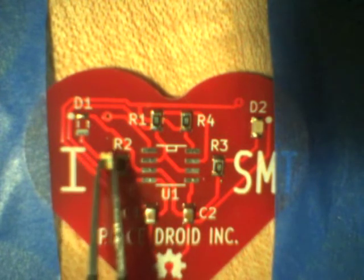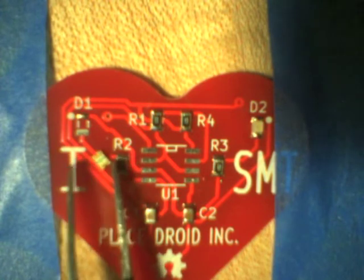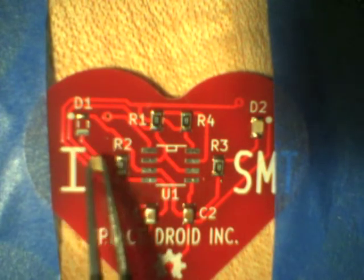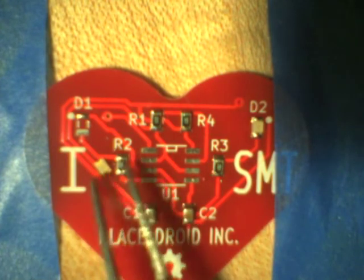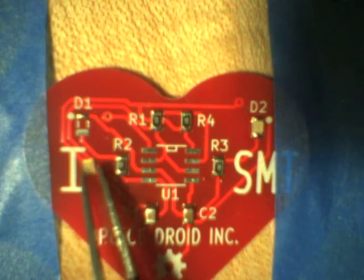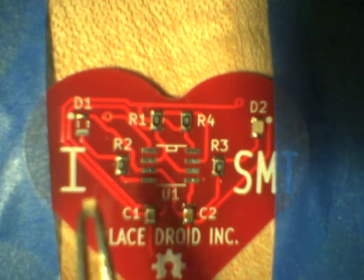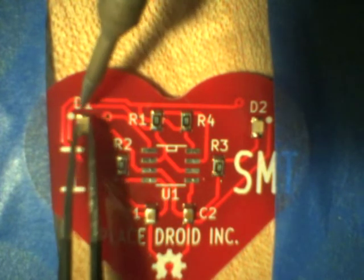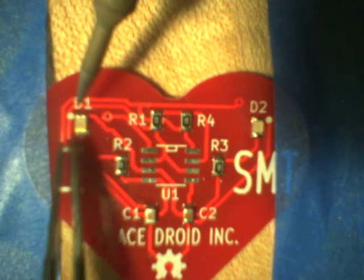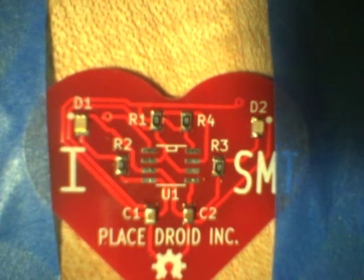We've got one more LED to go, and then all the small components are done. Again, it's important for the LED to go around the right way. Look for the green T on the back. Turn it over. Get it ready to go. Hold it in place. So just be careful you don't turn it around, although you're not going to blow up an LED by having it backwards. So if it doesn't work, we just get to take it off and turn it around. Focus is a bit dodgy over this side of the PCB. Sorry about that. Okay, so tack down.